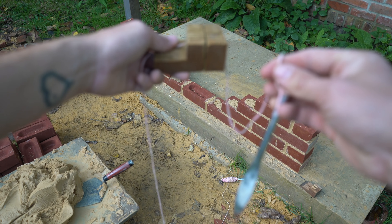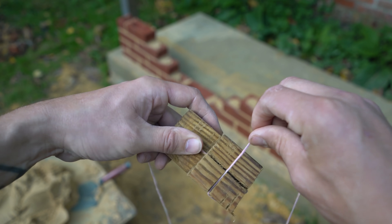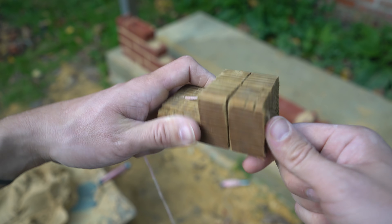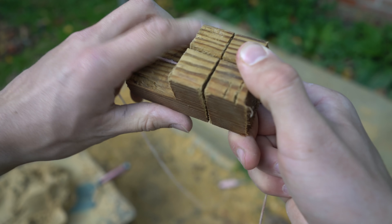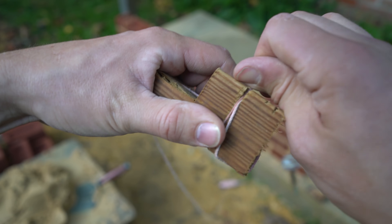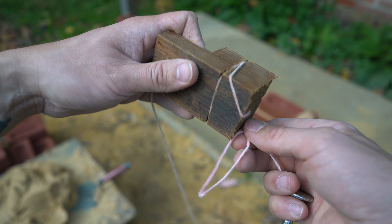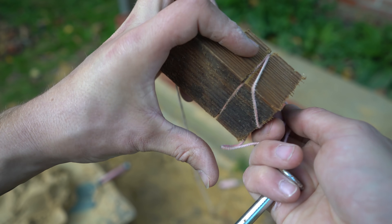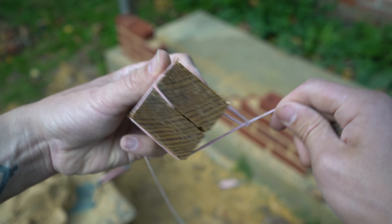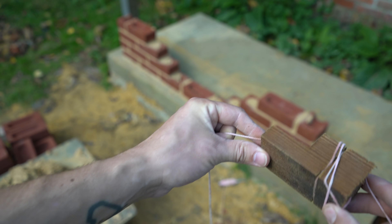You want a little bit on the back end of the block. Take the other piece of string and just wrap it around a couple of times. I like to do a little hitch knot — put a little circle and wrap it around so it's nice and tight. Now that's not going to come off. This then goes on the brickwork and pulls out taut. When you do it, do it as low down as you can because bricks at the top may still be wet.